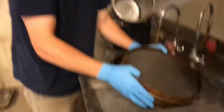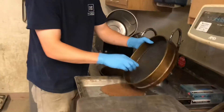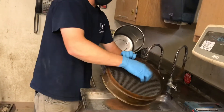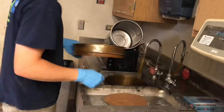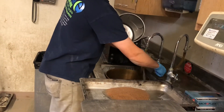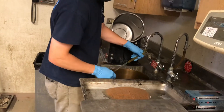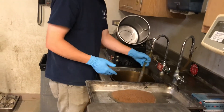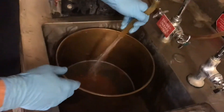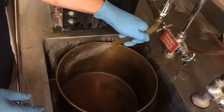I am going to take the coarse material from the top of the sieve and remove all that aggregate. Now I have to remove the material in the 200 sieve, and remember this is material retained on the 200, so we want it to go back into our pan.